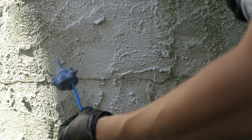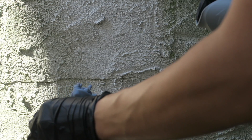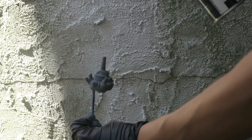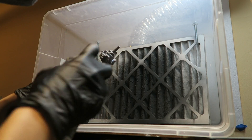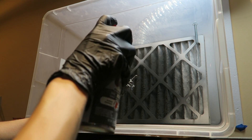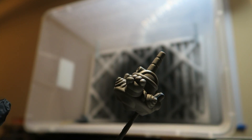Something I learned about primer is that it does not like heat and humidity. I did this during the summer and it was like 95 degrees and crazy humid out. I did a couple of passes when I realized something was off — my primer had sprayed out unevenly and dried before it even hit the surface of my print. This left it looking grainy and I had to sand it smooth all over again. I then decided to go to plan B, which was to prime them indoors. I used my homemade spray booth and turned on my dehumidifier. This helped immensely. Not fun, but a good learning experience.